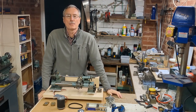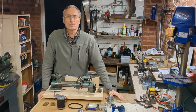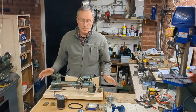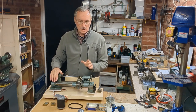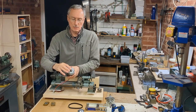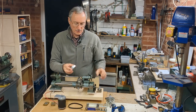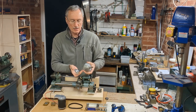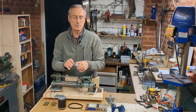Welcome back to Workshop Friend. Last video we took time out to make a mini boring tool using old and broken taps, and today we're actually going to use it. This is part 11 of upgrading my mini lathe. We're going to use that boring tool to bore out the tooth pulley which will go on the DC motor, and also the larger 60-tooth pulley which goes on the counter shaft. So we'll go over to the lathe and start boring these two pulleys.